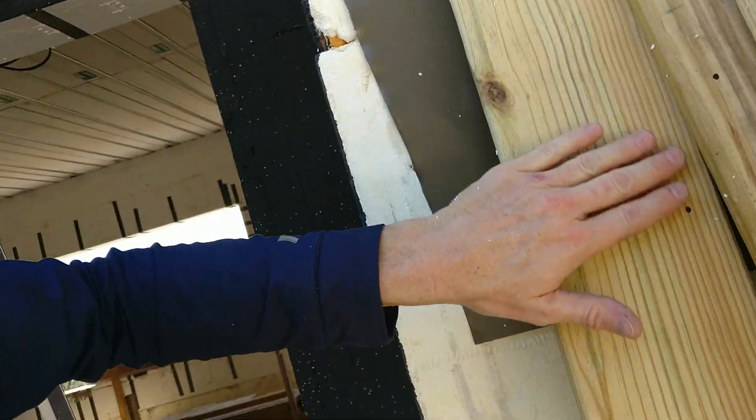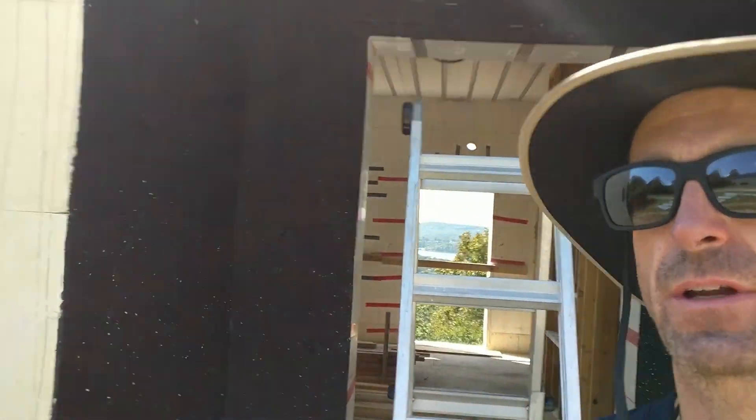You can see I have my channel cut. I'm going to stick my light out a little bit so the wash is more right here at the front of the doorway and washes the face of the door versus being up close and washing the wall. Hopefully we've got it dialed in pretty good. Now I'm going to work with the drill press and countersink all my holes, then lay maybe four or five boards before I get close to my light, put the two together, put my template on it, cut it, and put it up.